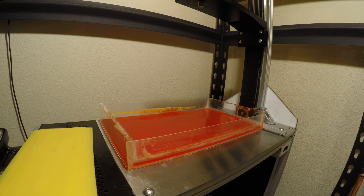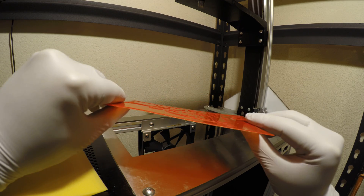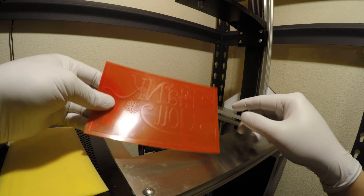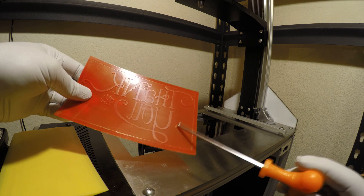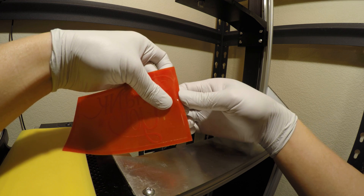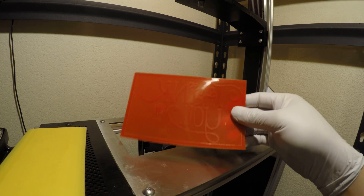Here is the finished press plate. It's inverted and it's got the frame. The frame is slightly shorter than the type, and there's a tiny half-millimeter seam between the bottom of the plate and the frame. Along that seam it should be relatively easy to run a knife, or in some of the thinner parts simply bend it to separate the frame from the underlying plate. And there it is — a letterpress plate with Funto-Do standard blend on the Kudo 3D Titan 1.